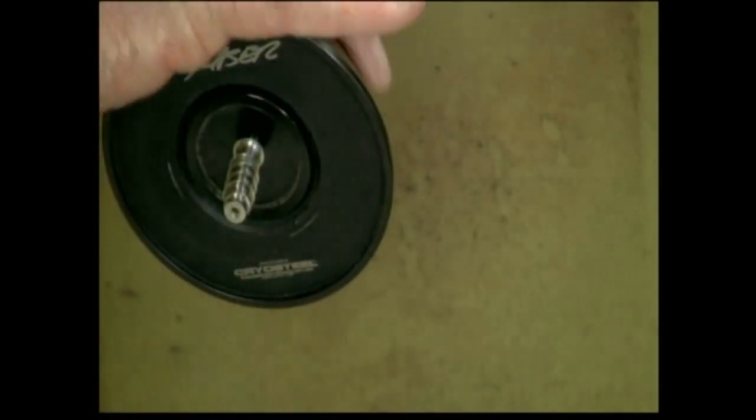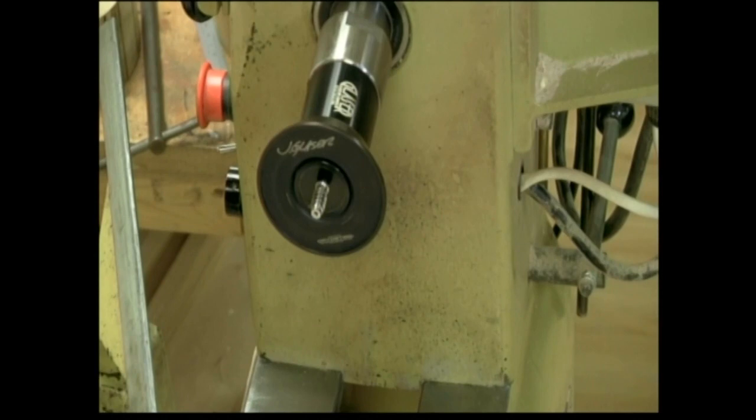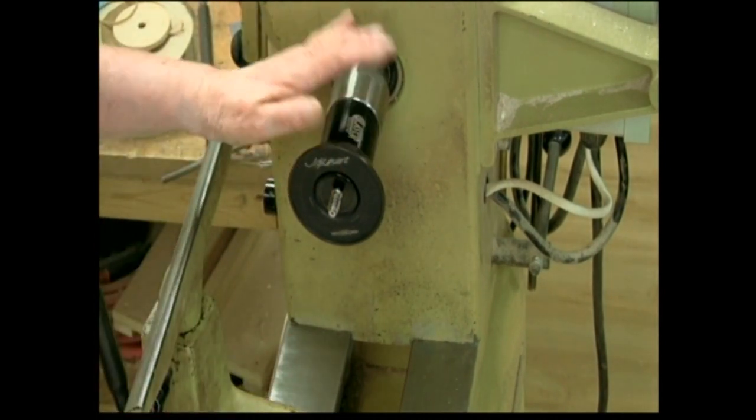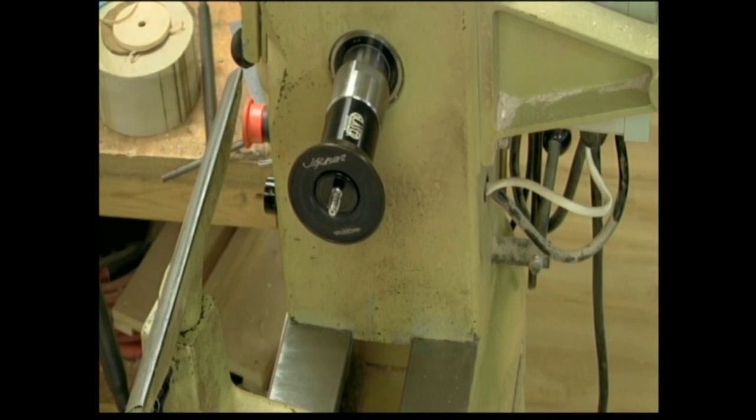Isn't that chuck designed to where you can screw that one piece out? Yeah, you can. That's the other thing nice, is I can reverse and have a smaller part if you're turning something smaller. So I have a setup at home where I have 2 lathes. I have a regular lathe like this, a One Way, and I have this on there. And then I have a short bed English lathe. So I can go back and forth, and I do this for reverse chucking and go to my other lathe with this chuck, turn the inside, go back to here.